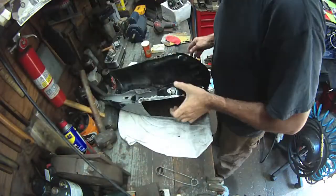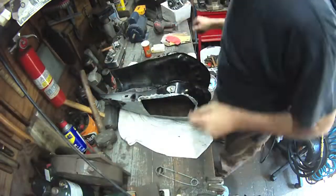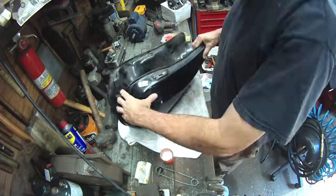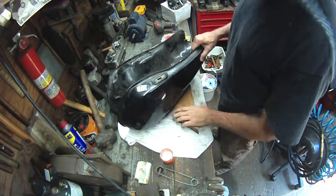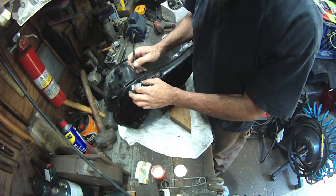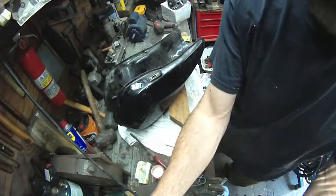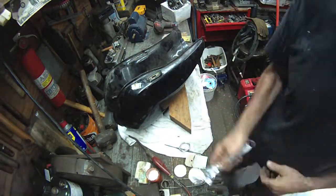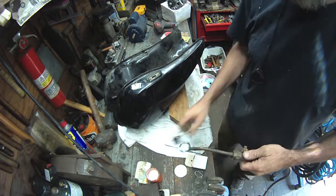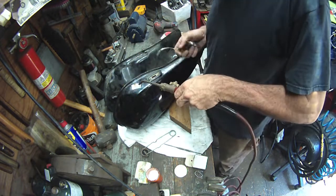I'm using silver solder, I'm using acetylene, and I'm using an acid core or rosin — the same type of rosin you'd use on a radiator — and I did that because of the dissimilar metals, the brass against the tank. I really wanted to make sure I had a good etch and good contact because I really don't need any fuel leaks. Unfortunately, that powdered rosin got a little moisture into the container and it's a little more solid than I want it to be. So that's just silver solder of the same composition.